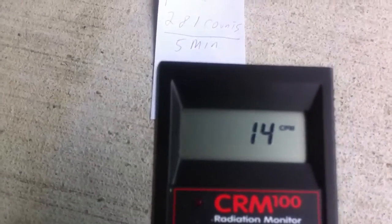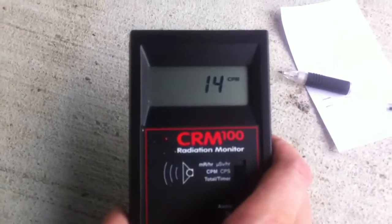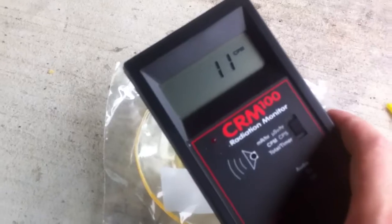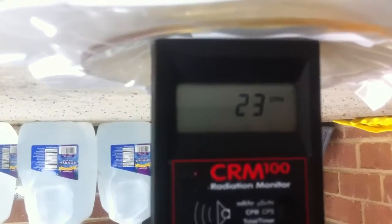As you notice right here, you're not getting very much from this distance, because all we're going to pick up is the gamma — and there's some gamma, but it's not a huge amount. Even right over top it doesn't do very much. If you stick this right on top of it, really really close where it's able to get a good view of this little Geiger-Müller window — which is this little window in the end, it's called a thin-window Geiger-Müller tube — it allows you to get close enough to get a good view.